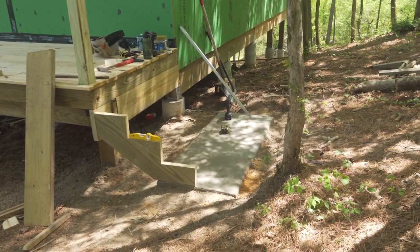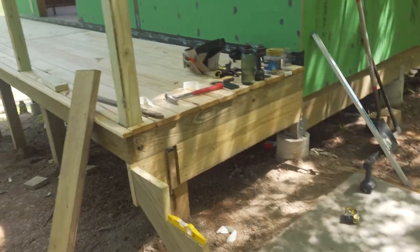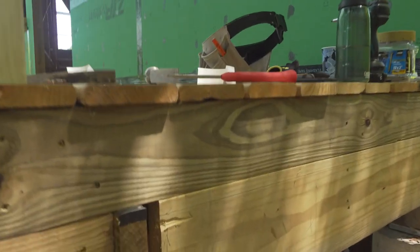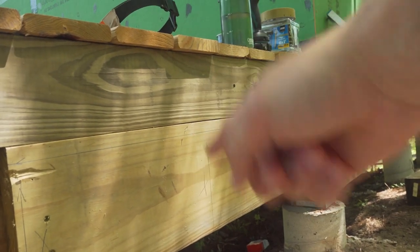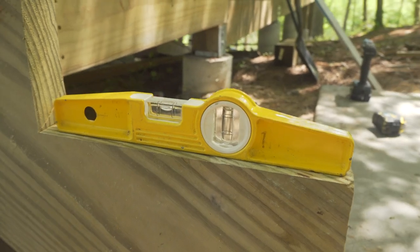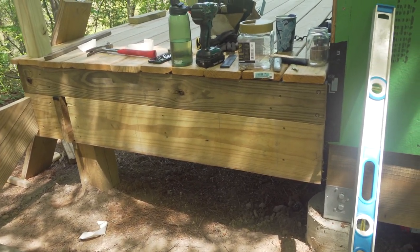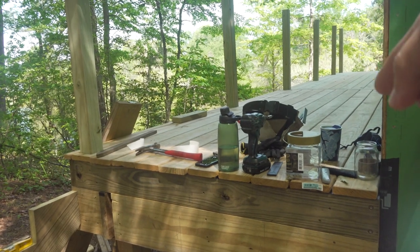It's the next day and my little pad has cured — it turned out okay. Now I'm working on laying out the stringers and had to add some blocking. I had to add a 2x10 because the stringers are going to sit at this level here where this line is, and I just had to put some blocking back behind there to tie it all in together. I've cut out the first stringer and it's looking pretty good. I'll probably cut one more using the square, and if that one's good I'll use that as a template. I'm going to have 5 total stringers because I want to use the decking and I need a stringer every 16 inches.